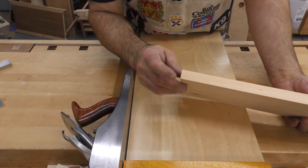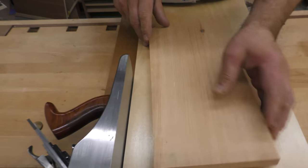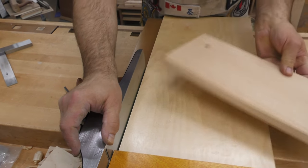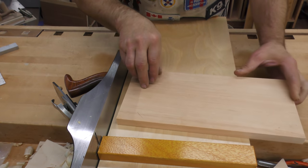Actually, I went a little bit too far — you see those fibers breaking off? The only way to get rid of that is either make your board narrower by going in and cleaning that up, or taking more off this way. The first one is probably the easier one to do.